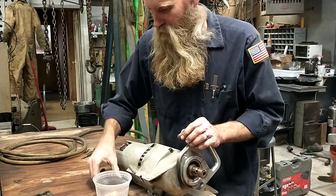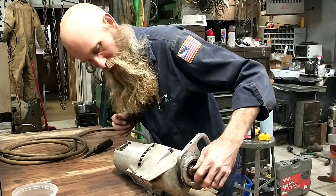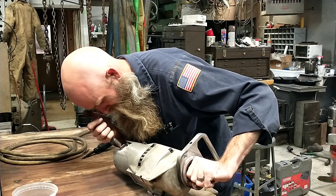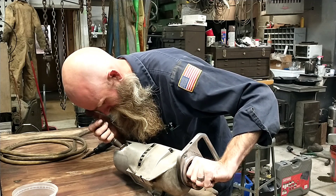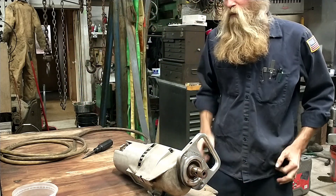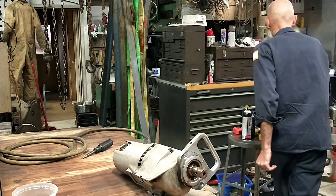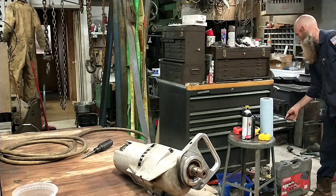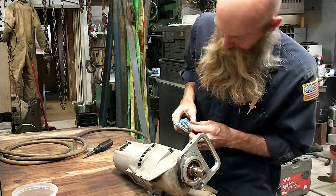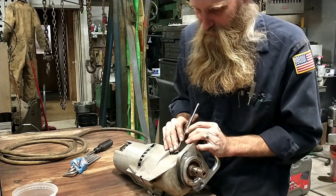My new brushes look fine — I ran it just enough to finish the cut. I don't think the brushes are burnt yet; I've got a couple of commutator bars that are arcing, and that makes a stinking lot of heat. You can cook one dead in a pretty big hurry, so I've got motivation to get this straightened out. I can't be frying unobtainable parts, and honestly I've had it in the back of my head that this day was coming.